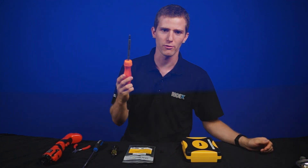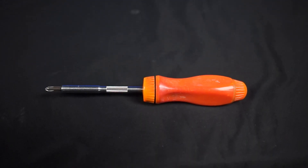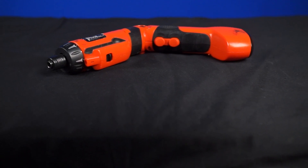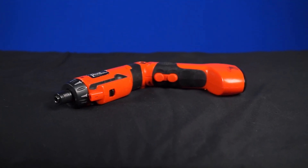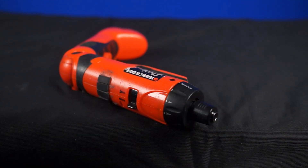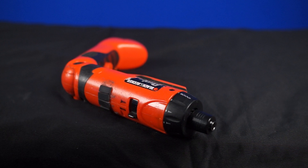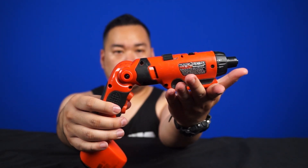First up, my personal screwdriver. For the technicians on our assembly team who build anywhere from 50 to 100 systems a week, they require motorized screwdrivers for maximum efficiency. We use long-reach Black & Decker electric screwdrivers with adjustable torque settings. Having variable torque is absolutely essential, as without it you can pretty much guarantee that you're going to strip some screws.